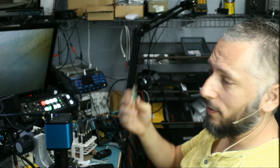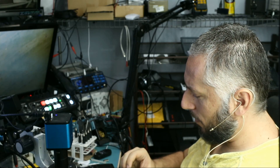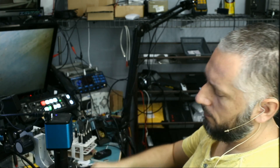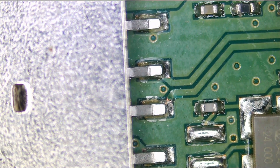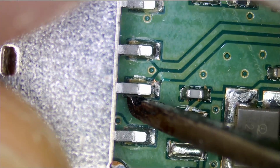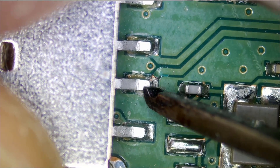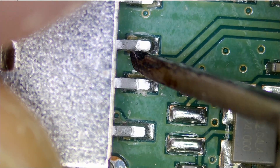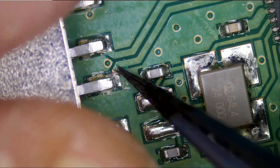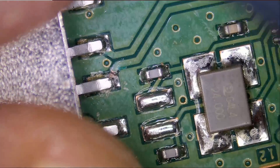Let's work on the USB flash drive. Customer said the drive is bent. I do not see it as being bent, but maybe there's something else going on with the drive. It does look like it may be wobbling a bit. I do not see any broken pins — let's see if those pins are solid. This one is solid, and this one looks like it's broken right here. That's our problem. Maybe we can scratch the mask here and expose the copper, and I'll just add one solder blob there.